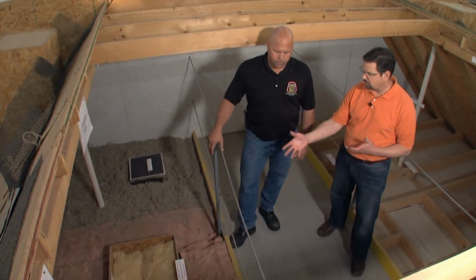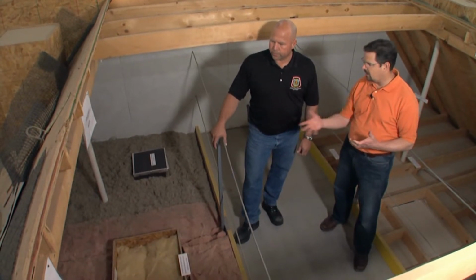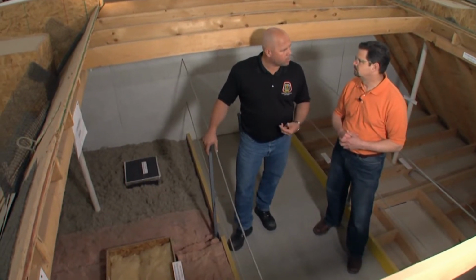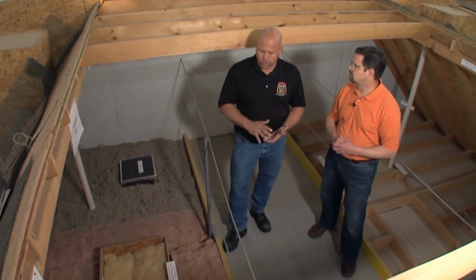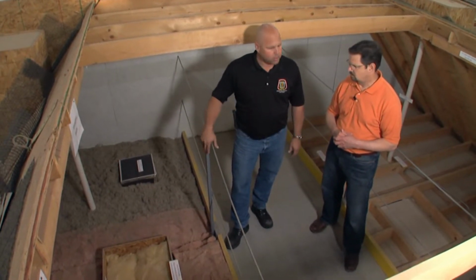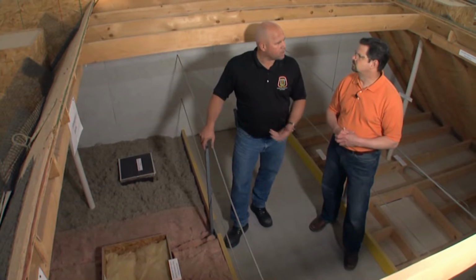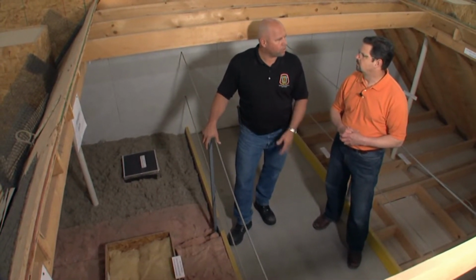Right. And what's important too, people don't realize you have your attic access, scuttles, things like that. Everything you want to make sure you're insulating. Correct. Most attic scuttle holes are a sheet of drywall that was cut out. They put the drywall on top of a trim package, and that's it. It needs to be gasketed. It needs to have some weight to it. So we add rigid foam to this to build it up, and then we add insulation. So our scuttle hole should be R49 if the rest of the attic is going to be R49. So we need to match the R value over that.